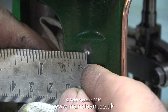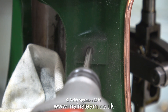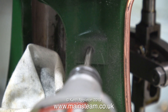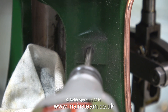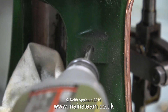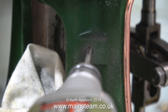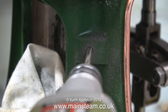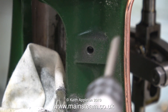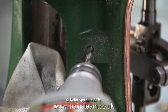A quick final check tells me that these holes are exactly half an inch from the inner part of the crosshead guide. So now with the speed turned up, I'm applying quite a lot of pressure to the drill bit, and as you can see it's cutting the cast iron beautifully. Be aware though that if you let the speed run away, you'll just blunt the drill and it will stop cutting. It's most important to keep constant pressure on the drill bit. I put a cloth over the working parts, but there's still going to be a bit of cast iron residue floating about — I will blow it all away with my airline before I finish, but the cloth catches the majority of the clippings.